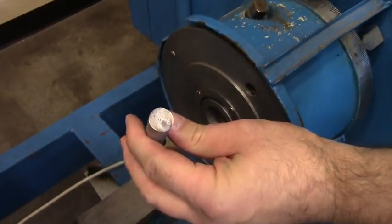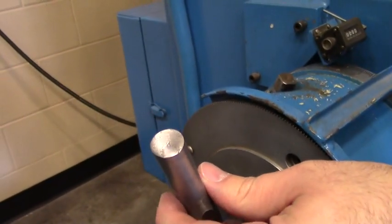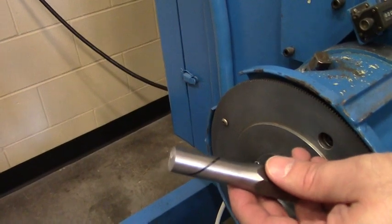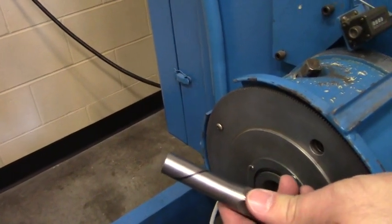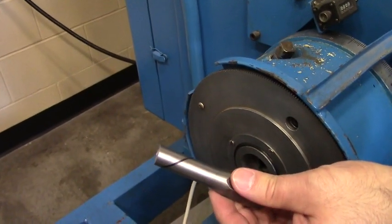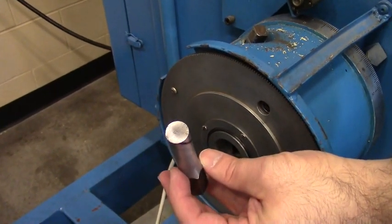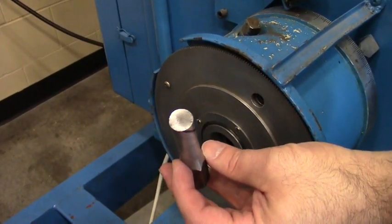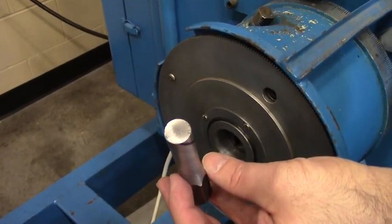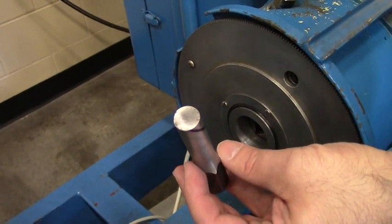A nice look at that fracture surface. It's a very flat fracture surface. This was a ductile steel. And there was a line that I drew on that before we started testing, and it's turned into a helical shape now. So that really twisted that metal right up. Very flat fracture surface, indicating that the maximum shearing stresses are straight up and down in our specimen. Ductile materials tend to fail because of high shearing stresses, and so we have that shaped fracture surface.